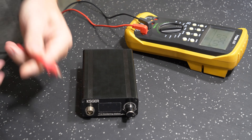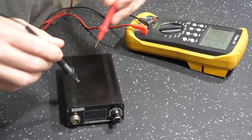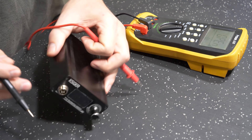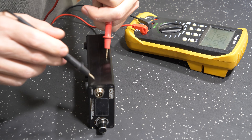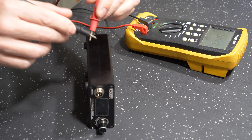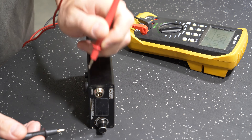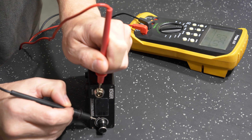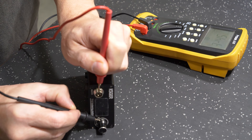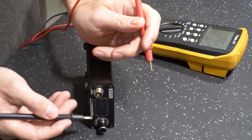I've got my multimeter here set up on continuity and you can see if we probe around touching the metal case, no matter where we are, because it's anodized we do have a degree of insulation. We're not triggering the continuity. But when we look at the outside socket and underneath the potentiometer here, underneath the dial, we've got continuity because we've made a connection electrically between the sockets and the front chassis panel, which is also aluminium.